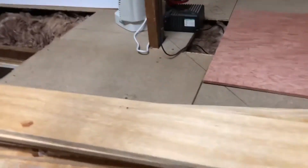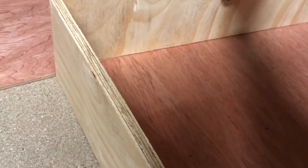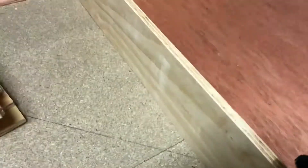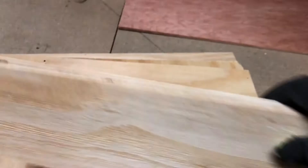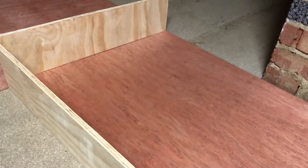What I'll be doing is building the actual frame out of these. One will sit like that, the short ones will sit like that — obviously sitting higher than proud because it's on top of the baseboard, but just so you get the idea. The long ones run this way, the short ones run that way. I'll use two of these and two of those, and then I'll probably chuck some support across. I'm not sure if 12mm will be thick enough to get the screw in, but it should be. We'll put four of these across — two on the outside, two in the middle — and then two of the 4-foot sections, and they'll all bolt together to pull them tight.